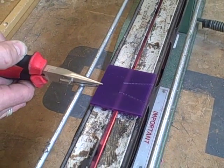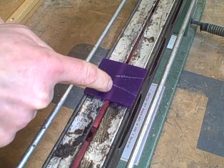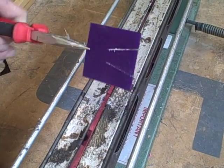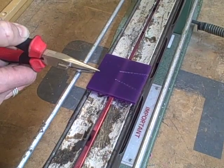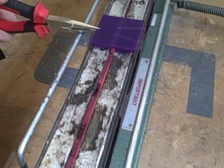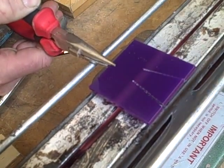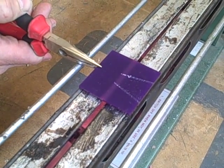I'm going to heat through on one side and then partway through that process I'm going to turn it over, ensuring that I position it again so that it's in the middle and we get an even heat through. You may have to repeat that process a couple of times, heating it and then turning it again. It's important that we use pliers for this because everything around here gets extremely hot and you would burn yourself if you touched it. Now hopefully you can see on this video that this section has actually become soft enough so that we can bend it.